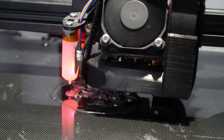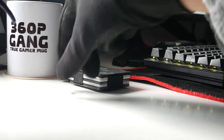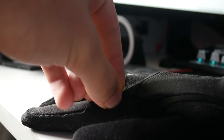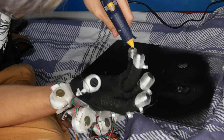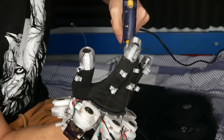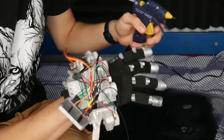Now is a good time to take the guide nodes from prototype 3.1 and 3D print those if you haven't already. Once done, it's time to glue them onto the glove. Use a hot glue gun or your preferred method — I glued them straight on. You should have 3 per finger, but my hands are very small so I used 2 per finger. Now is also a good time to glue on the end caps. Make sure all your end caps fit correctly since you'll need a different scaled one for every finger, then glue them on and set the glove aside to cool down.